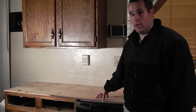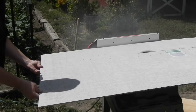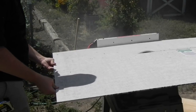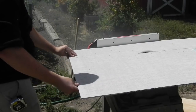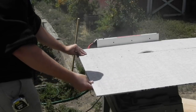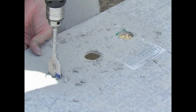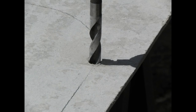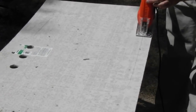After you finish cutting your sink hole and securing all the plywood to your cabinets, your next step is to cut your backer board. You do this the same way as you cut the plywood. Cut the backer board sink cutout the same way you did the plywood. If available, use a slightly larger hole bit to help ensure that everything will line up.